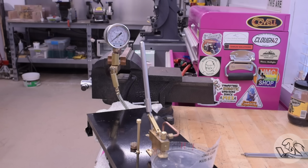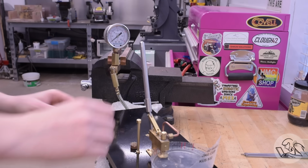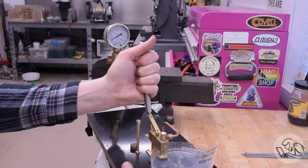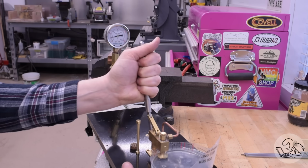As long as the pump can build that pressure, then we know the pump is going to be able to force water into the boiler at 100 psi. So don't worry about the fact that it bleeds down really quickly. That said, I don't want the test fixture aggressively spraying me with water, so I did improve it a little bit, just enough so that we can do this test in a reasonably civilized fashion.